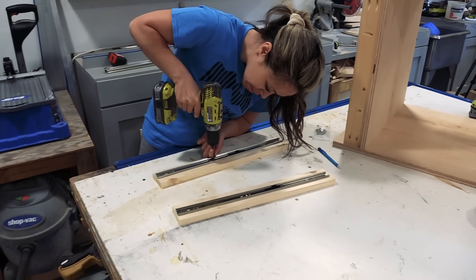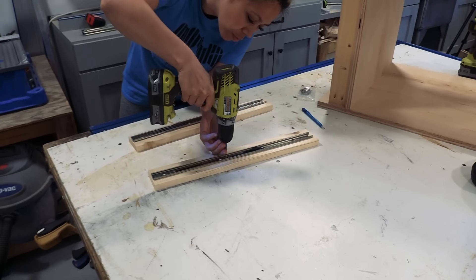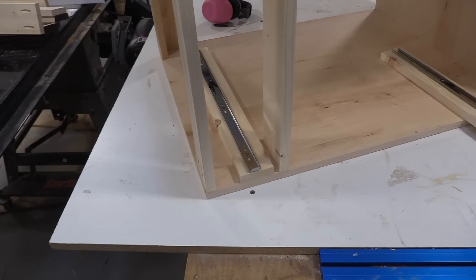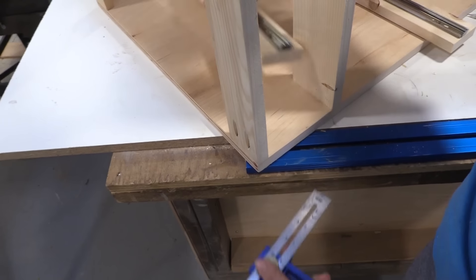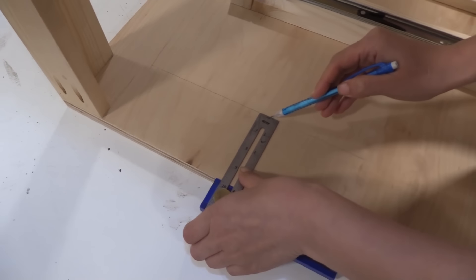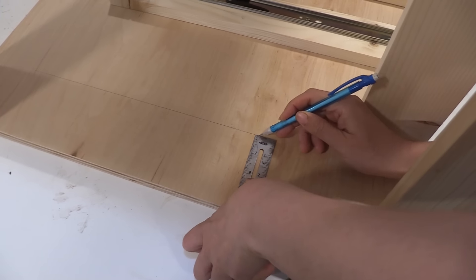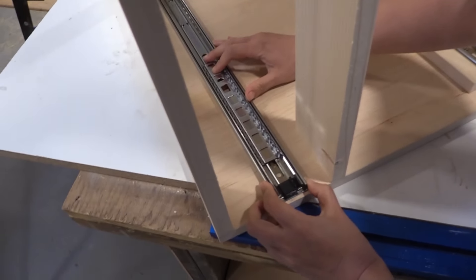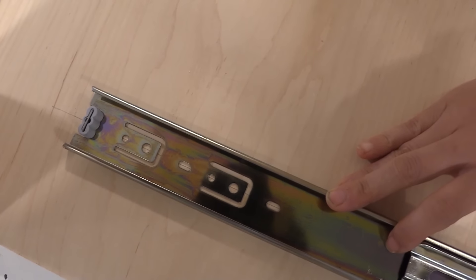This method is a little different, but it enables me to make perfect sliding drawers on the very first try without doing any math. I just figure out where I want that drawer side to be in the cabinet and draw another line. Make sure you're considering adding a bottom to your drawer and a little bit of room so your drawer doesn't rub on that divider piece. Then just install the cabinet member on the line with screws.